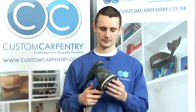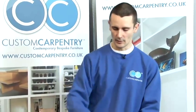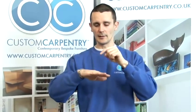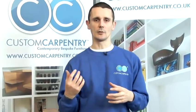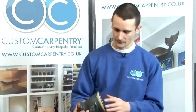Okay, now I'm going to show you how to use the random orbit sander. The random orbit sander is a very good sander because it not only spins round in a circle like the normal orbital sander, but while it's spinning, it also gyrates. So this spinning, the gyration and the movement of your hand creates a much finer scratch-free surface.